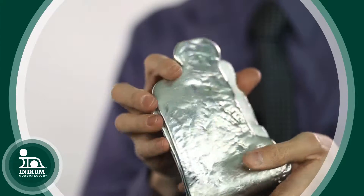It does interact with copper, which can be a blessing or a curse depending on which way you look at it. It does form indium-copper inter-metallics, which are kind of stiff and brittle. The blessing part is that if you have copper, which as a metal is kind of soft, and you wanted to harden it up, you can actually electroplate some indium on there, let them inter-diffuse and react and form those inter-metallics, and it will make that piece of copper stiffer.